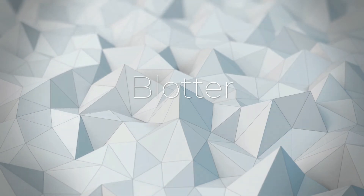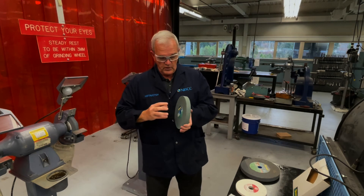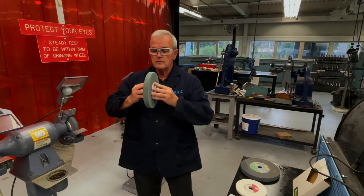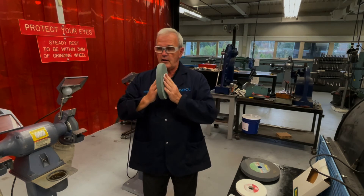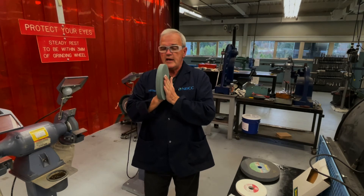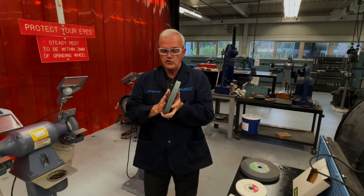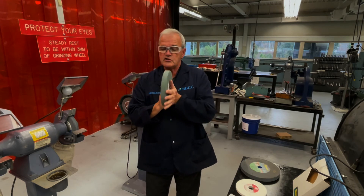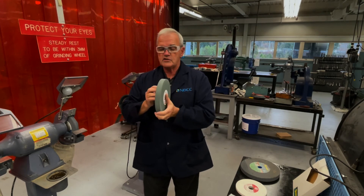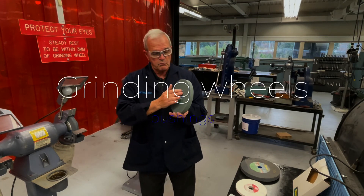The blotter is also used on both sides of the stone so that when you put your two flanges up against it, the blotter provides a soft cushion for the flanges. If there were a piece of dirt or a metal chip in the stone and you didn't have a blotter, when the flange comes up and torque is applied as you bolt it down, it could set up a stress fracture. So always make sure there's a blotter there.